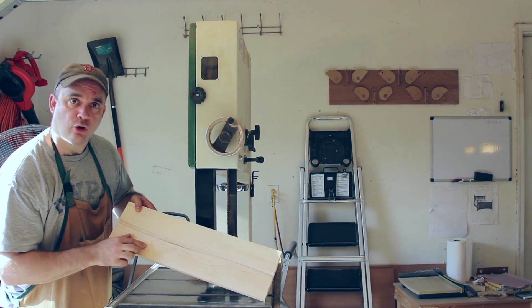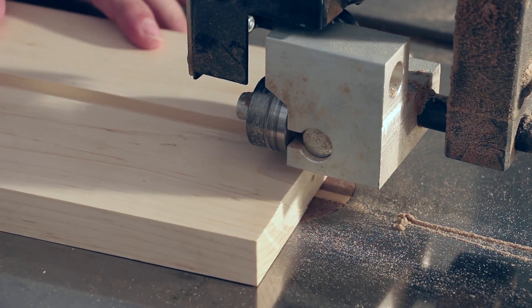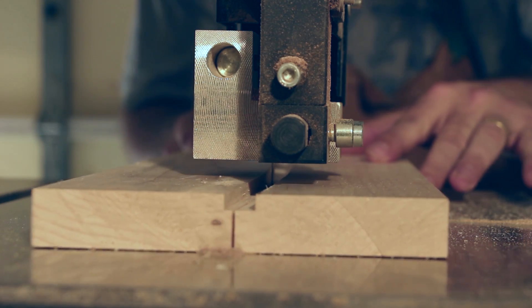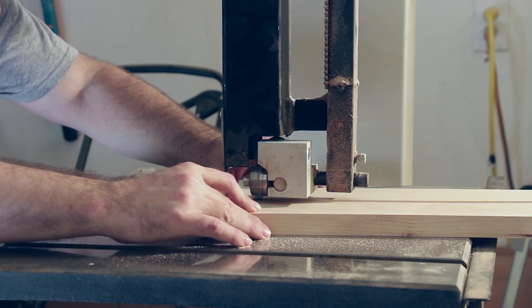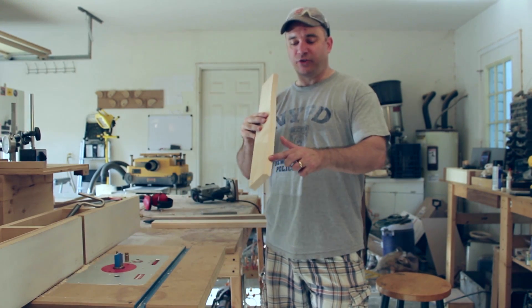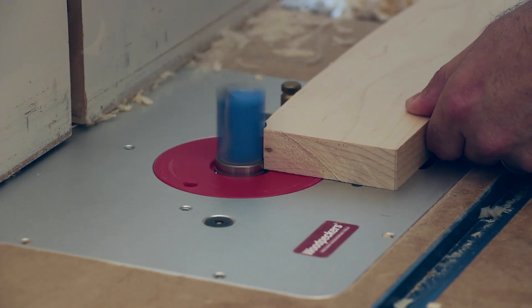In the Fine Woodworking article the author claims that he cut along the channel staying close to one wall of the groove. With a pattern bit at the router table I'm going to flush the bandsaw portion that we just created down to the routed portion that we created with the template.